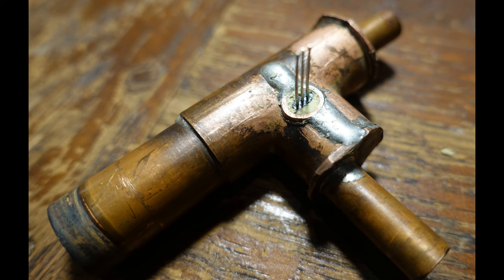Because of what I thought would be insufficient resolution, I developed a system using a platinum 100 ohm or PT100 sensor, which I'll describe in a future video, but having done that, I have new respect for the DS18B20. Compared to more ambitious systems, they have two major advantages. Firstly, being digital, they are resistant to interference and noise. And secondly, in my experience, they have been extremely stable.